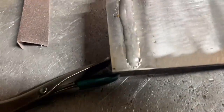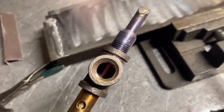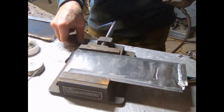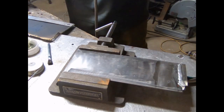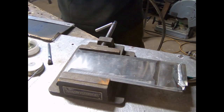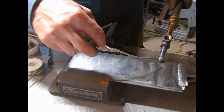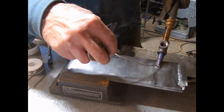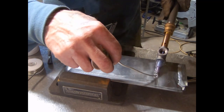The GoPro picked that up. This thing just laid a beautiful bead of silver solder on stainless. I'm going to try a different solder on this one. This is some great flux that I'm using here — a lot of it's in the flux. Now this next batch of solder I'm doing is going to be nickel-bearing solder. It's a little bit different — it's a heavier, dutier stuff. Takes a lot more power to run it, and it's a thicker solder for filling in thick gaps.